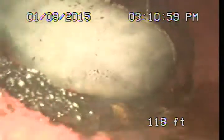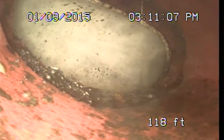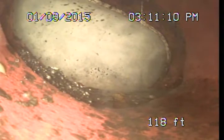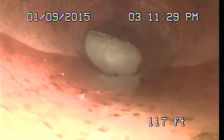As you can see at our public connection here, it's a little bit jagged. This is a connection known as a saddle connection, so it was put in after the fact. In other words, they cut a hole in the side of the city sewer and have a pipe fitting that goes over the outside of that pipe, sealed with mortar. That mortar tends to deteriorate and start getting roots and such, but it's pretty typical. Certainly something to keep an eye on, but I don't see any issues with it right now.